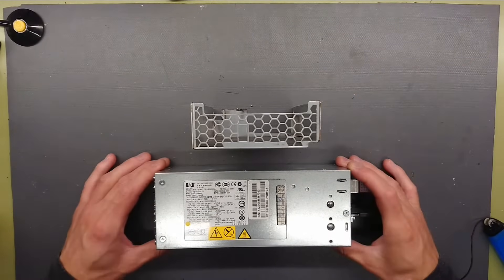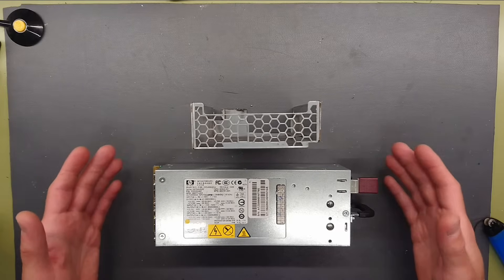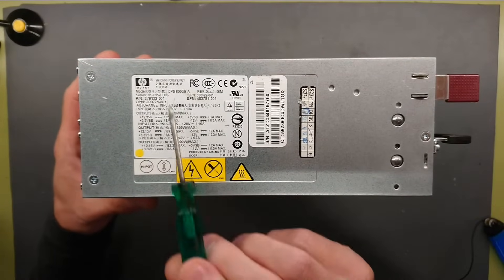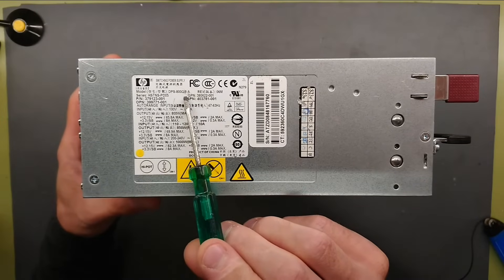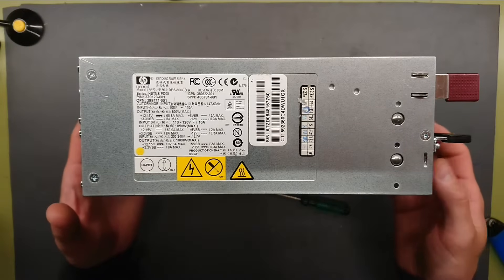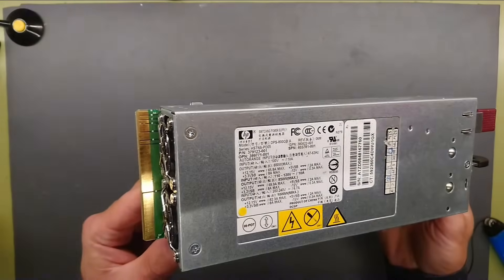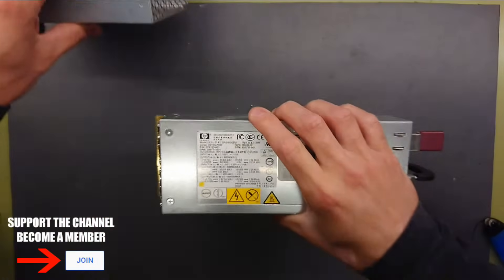Hi all, Maz Bancop from Kaiser Power Electronics. When I get by servers that are thrown out, the first thing I do is pull out all the power supplies and quickly look up the model number. In this case it is a HP DPS 800GBA. What you'll quickly find with a Google image search is that someone else has reverse-engineered the control connections in order to make it run outside of the server environment — and that is the case with this power supply.